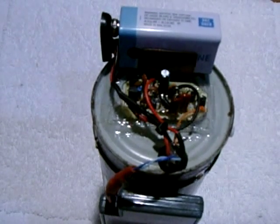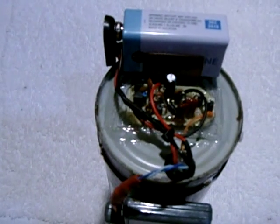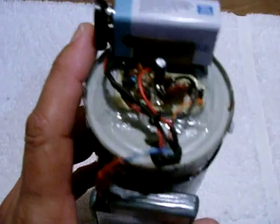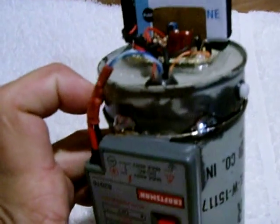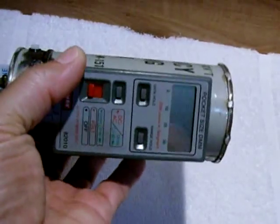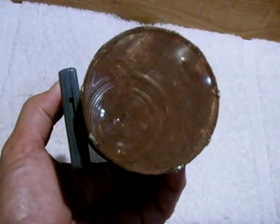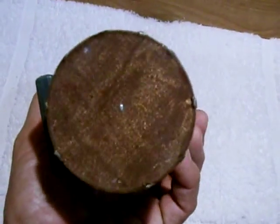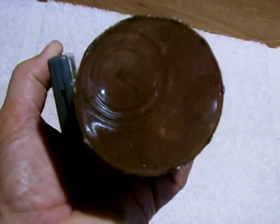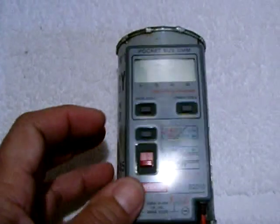From the sense wire you'll solder on your high-value resistor, which you can get out of an old radiation survey meter — you can see them on eBay, the big yellow boxes with the handle. There are also sources online where you can buy that particular high-value resistor — it's a Victoreen. So the circuit is: 9-volt battery, high-voltage board, other components under the cap, all shielded and soldered, my on/off switch, my DMM set for millivolts, and a copper screen over the end to allow alpha, beta, and gamma to enter the can.